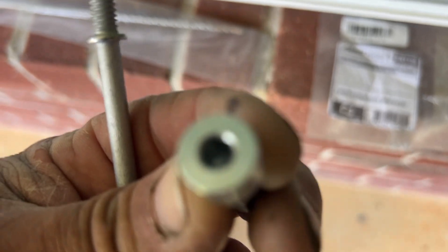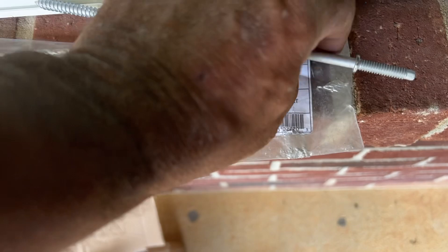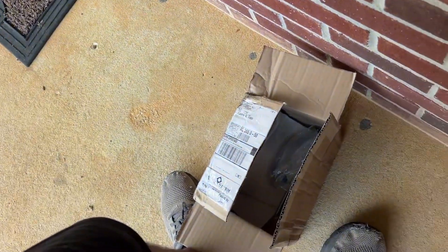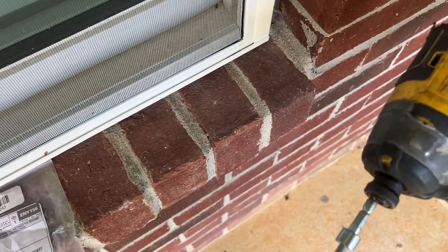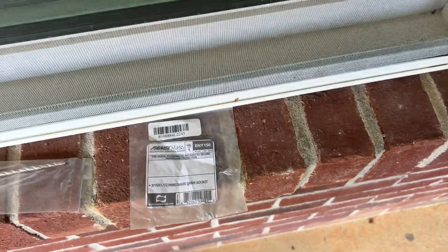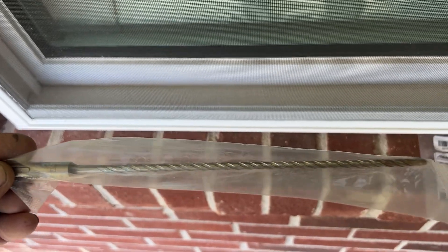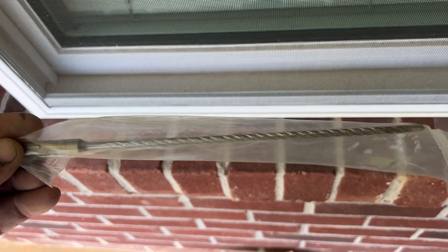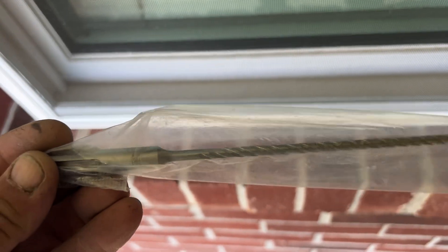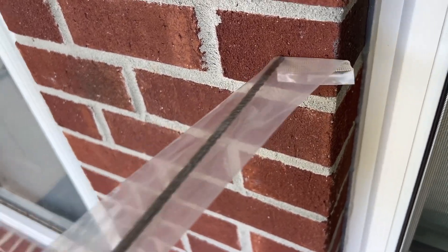Three-sixteenths being the diameter. These two pieces — this bit just goes on to the end of it like so, and around the back like so, and you need to drive them in. You're also going to need a quarter-inch drill bit. It's going to have to be a long one for sure — at least six inches. You don't have to have an SDS bit the way we're going to do them into brick.